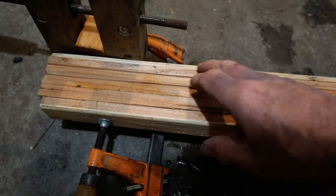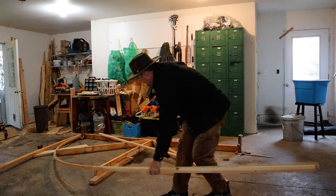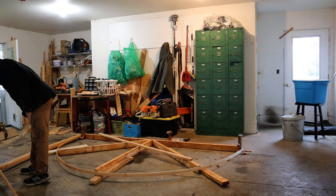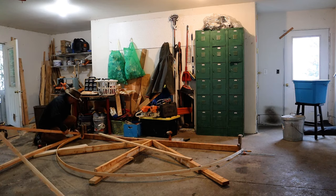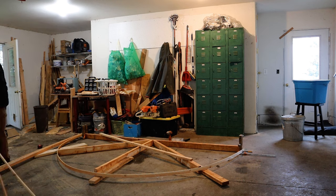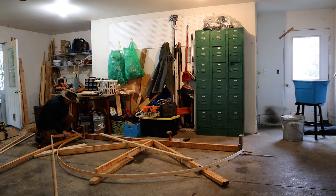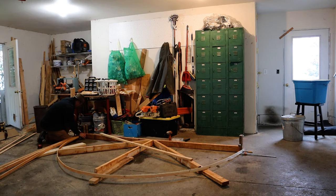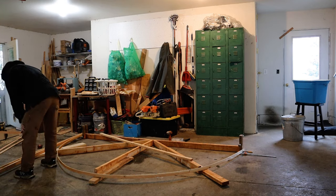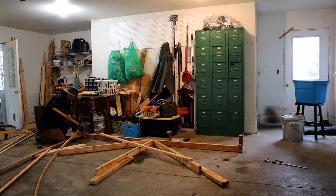I had two different styles that I tried — this is the one that worked. My first attempt at building these trusses was to build a jig to bend quarter-inch strips of wood together and then glue and screw them together. Fortunately, I did not waste too much time cutting too many strips before I was able to see if this would work, because I found that if there's any kind of knot in the material at all, it was going to break and this was not going to be effective.